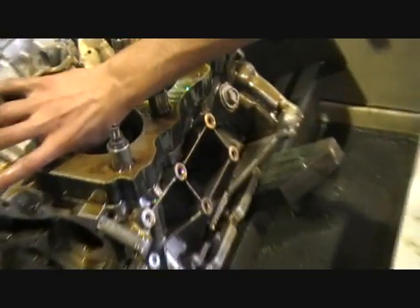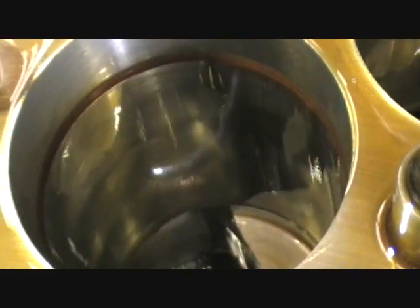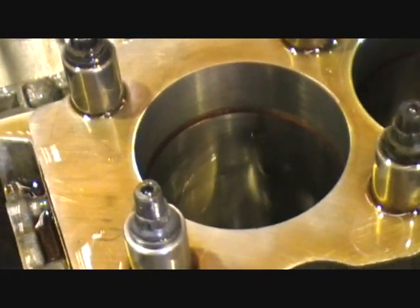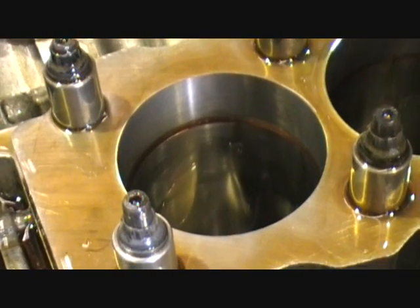We should be able to just clean this over and put the oil in. Have a good look in there — you can see the honing pattern. That's the finish that we need. It's got about a 25 to 30 degree honing angle crosshatch, which is what's needed for these rings to get the maximum performance of sealing out of them. And now this one's ready to go.